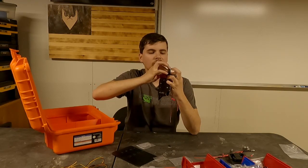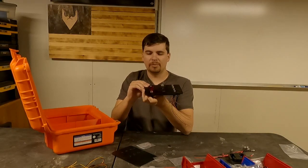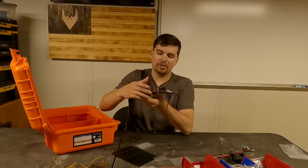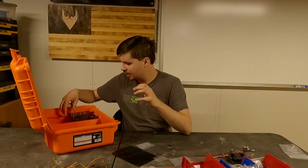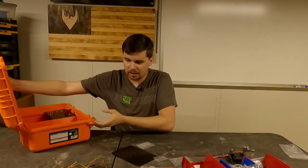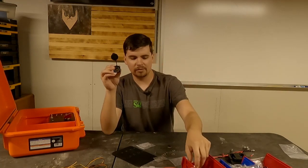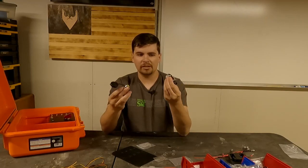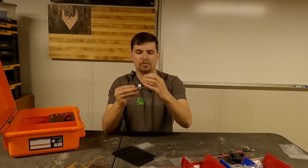These are a lot harder to put on when you don't have a wrench. That'll be our master arming switch — bring everything up, you can also arm it all in one motion. Then we'll have our fire switch out the backside going to the pad. On the back of the box, you'll notice there's a hole — we actually have a 10-pin connector so we'll be able to control 10 pads down range. I said I'll have an auxiliary attachment that'll go on this board later. I've got a connector that plugs in and then screws on.